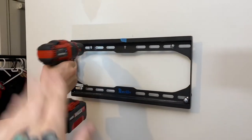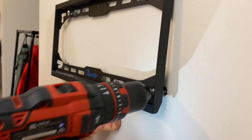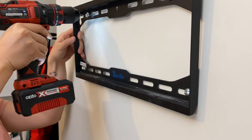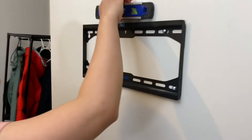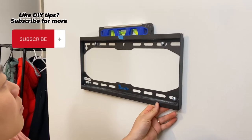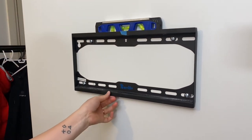To get the wing to start engaging and tightening against the wall, pull on the mounting bracket towards you to create a bit of tension, then tighten them up evenly as you go around — otherwise it can be a bit fiddly. Just before you tighten everything completely flat, grab the level once again and make sure the bubble is in the center before hand-tightening with a screwdriver. Wendy checks it feels nice and strong — heck yeah!